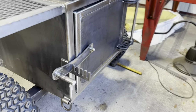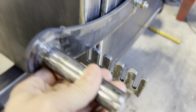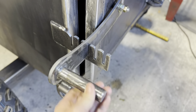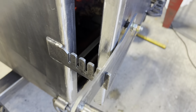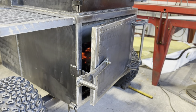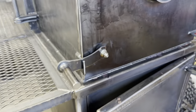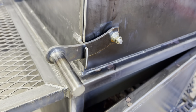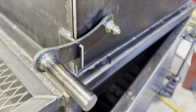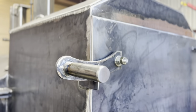Take a look at the latches. This is the latch we use on the firebox. It is adjustable for those guys that like to cook with their door open — they have one-inch increments where you can open the door. When I'm cooking, I like my door fully open; I want as much air as possible to get inside of that firebox. The latches for the warming cabinets are similar in principle, just not adjustable. They work as a compression style. This little plate down here has a bevel on it, so as you close it, it tightens up and seals it up real good.